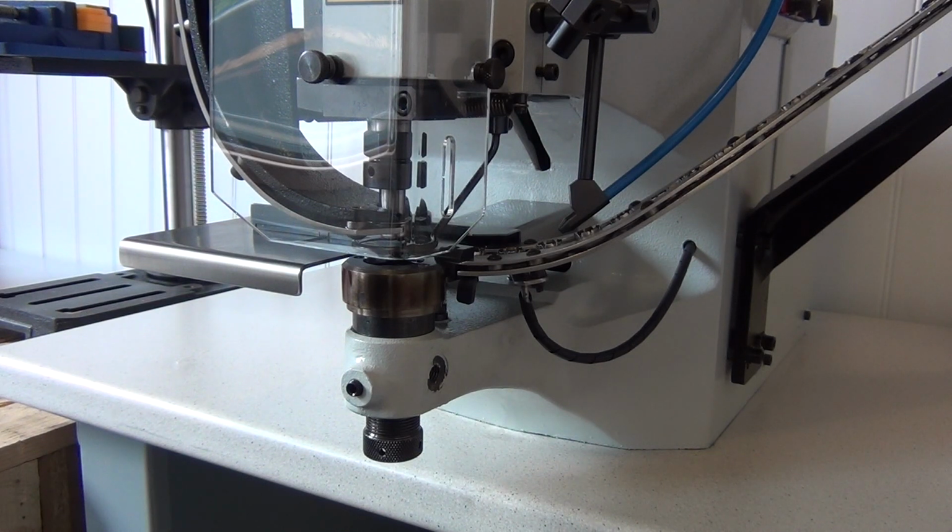The first thing we want to do is move the top and bottom dies away from each other. In doing this, we will prevent any possibility of a broken blade or a crushed setting. In this procedure, we will be working in what could be a very dangerous area of the machine. To prevent any possibility of injury, make sure any electrical and/or pneumatic supplies to the machine are disconnected.